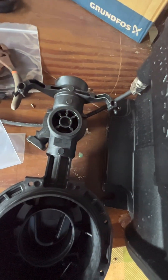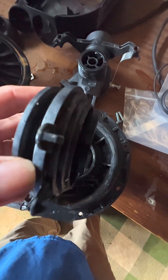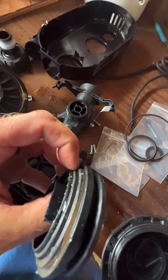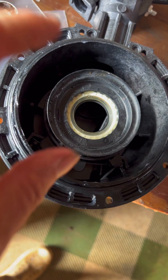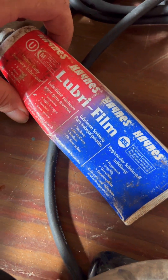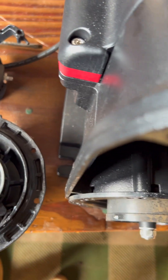We have to put that metal bracket on the new one using a 7/16ths nut. This gasket here is for inside the pressure tank. This gasket with a lip on it goes on the back side of this piece. The large o-ring goes right around here. I use a little bit of lube — this stuff called Lubrifilm, like a silicone sort of grease. With that all put back together, the pressure tank can get screwed back on.